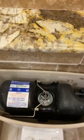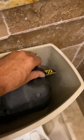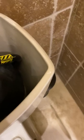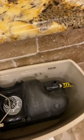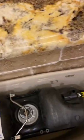Take off the cover on the back tank. We've flushed it and we've shut off the water. We take off this little cap — it's just very gently on there, not very tight. And you can see there's a little rubber duckbill valve in there. Usually that comes off in the cap and it'll look like that.